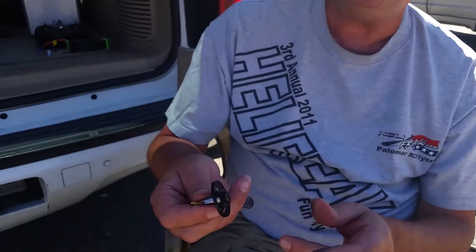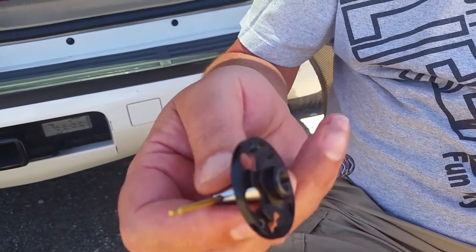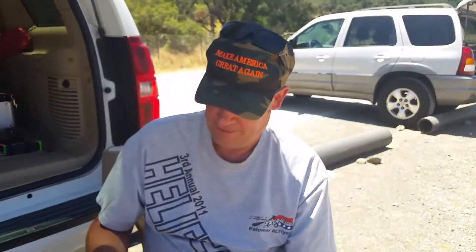For you, this is a little loose. I'm not sure I'd even trust green Loctite — you might just want to get this replaced. But if it were me and I had the tools, I would tap this and put two set screws in at about 45 degrees. Thank you very much, everyone.